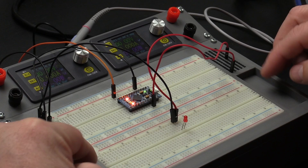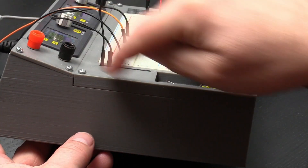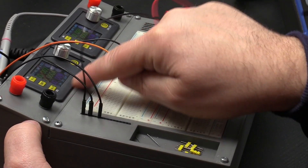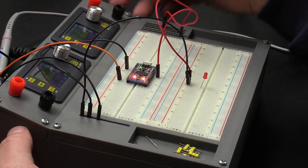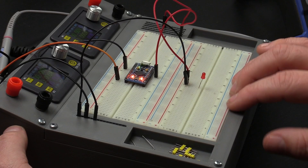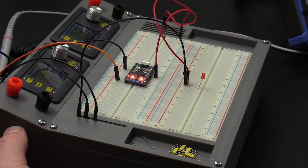There are some places where you can put your components, like resistors and that kind of thing. It's got a bottom and two different front plates on which you can put your own components if you like. So if you don't want to work with these power supplies — the DPS 5005s — you can, for example, buy DPS 3002s, which have a slightly different form factor, and build your own new front plate and use that. If you don't want to work with these 640-pin breadboards, you can use smaller ones and build a top plate for that. So it's very configurable in how you want to use it, and I think that makes it a great electronics development station — I made it this way, but you can make it a different way if you like.